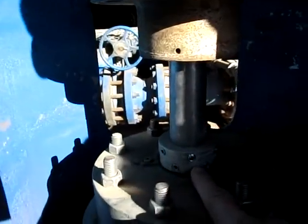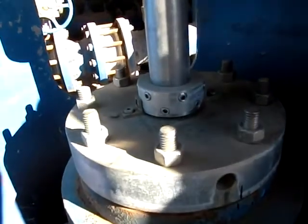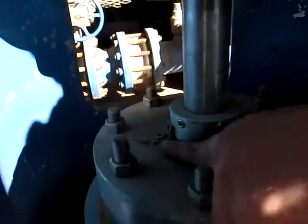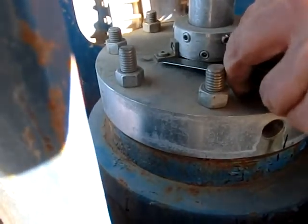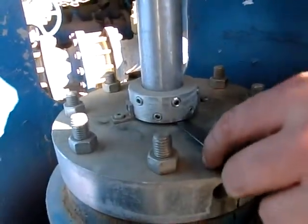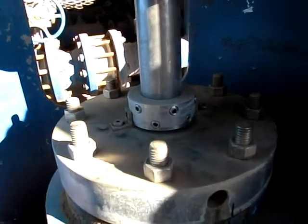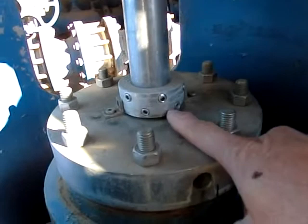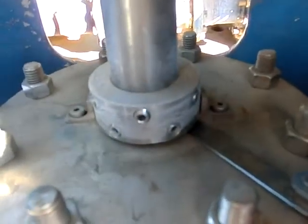These are loose too — all these. I put these tabs in here because that's what sets your spring tension on your sill. Now how does that set the spring tension? Because they're actually this thickness right there — that's a preset from the factory of what that spring tension is going to be. It picks up on this piece here. This collar has actually got another collar that goes inside that holds your bottom sill, and it picks it up against the spring. If I was to take these out, this collar would fall all the way to the bottom and you wouldn't have any spring tension on it. There's a little piece — I don't know if you can see it right there — and that goes under the collar.